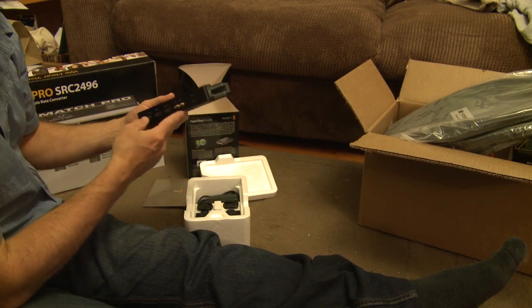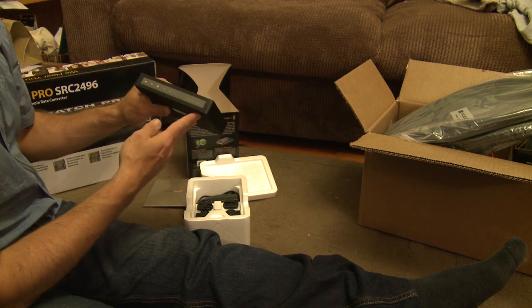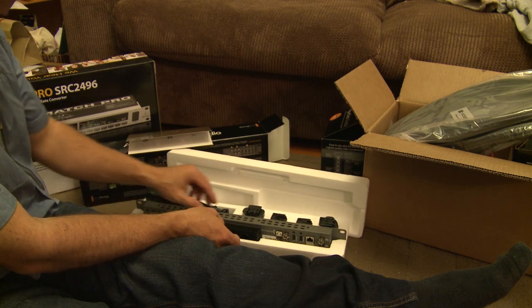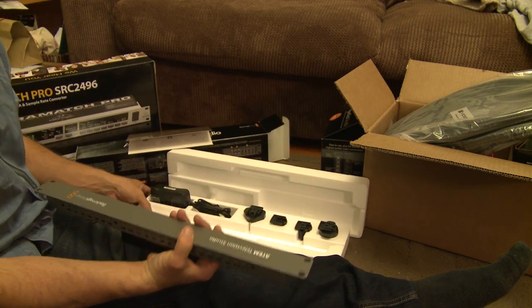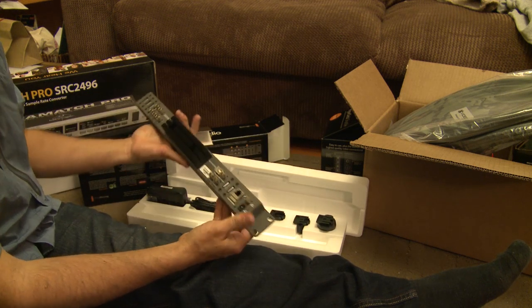What I'm going to run here is a shuttle — this is the HyperDeck Shuttle 2 from Blackmagic Design. It's got SDI video in and HDMI video in, so I'm going to be capturing the streams from the Television Studio. I need a couple of SDI cables to run the Duo monitors with two SDI ins. I'll be running two cameras with Blackmagic Design converters — HDMI to SDI.